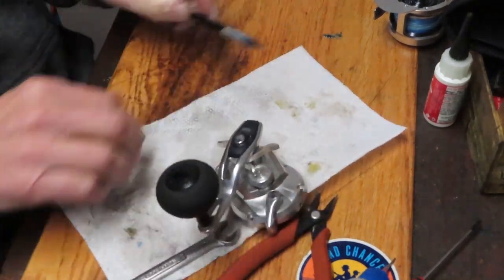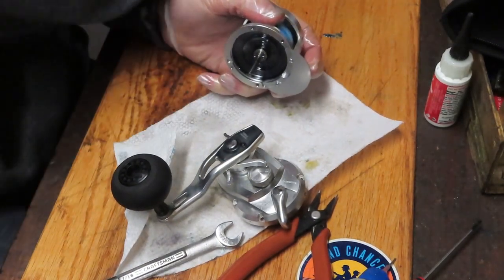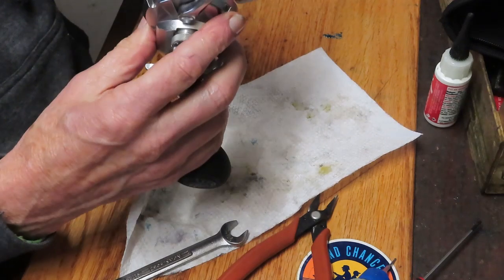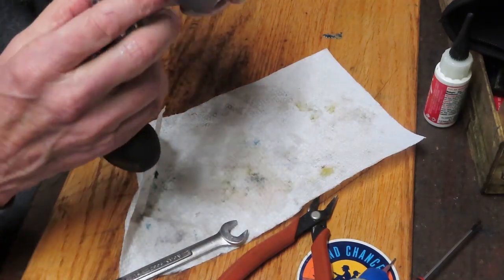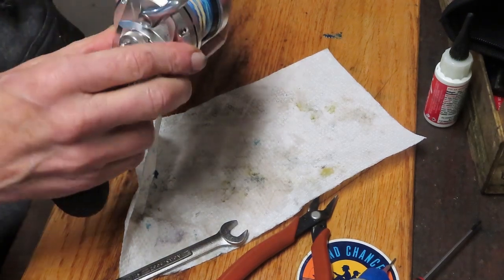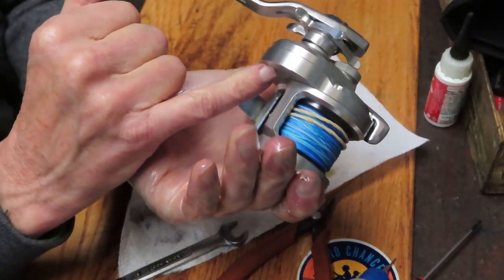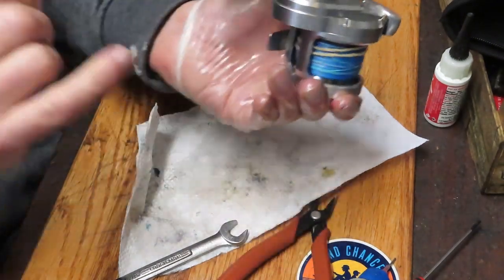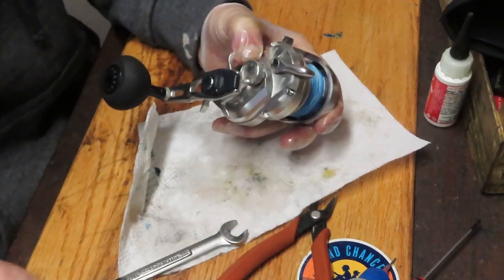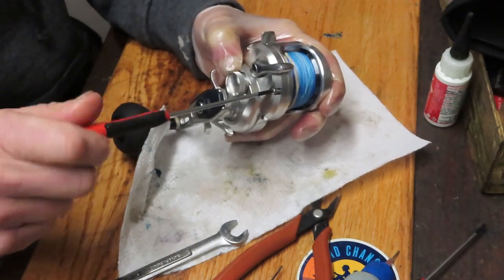Now what we want to do next is to install that onto the reel, and once we do that, we'll be able to take a test. Before you do that, just a little bit of grease onto the axle shaft coming off the spool. You want to locate the 4 holes. Generally you can do that because this is a solid metal piece off the back end of the frame that will merge with this. Remember, each of these screws has a little washer on it. These are Torx 8 size. So get your screwdriver and tighten that down.